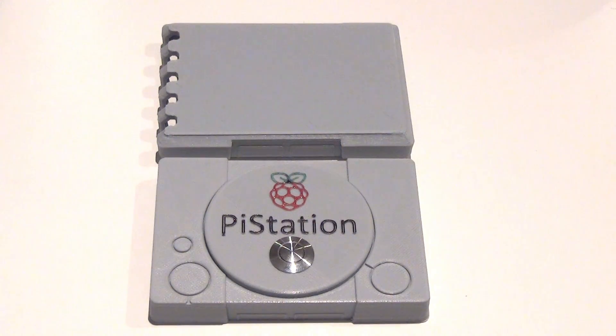The power button itself is a really simple momentary push button. When it's connected to the Pi and pushed, it will essentially bridge two of the pins, and what I've programmed my software to do is run a shutdown script. It's not a necessity but it is much more convenient than having no button at all. Powering down a Raspberry Pi incorrectly can actually corrupt your SD card, and the button prevents that — no matter what you're doing, pressing it will automatically go through a sequence to properly shut down your Raspberry Pi.